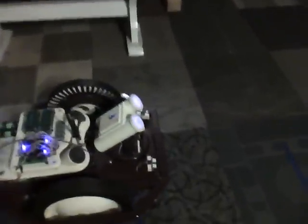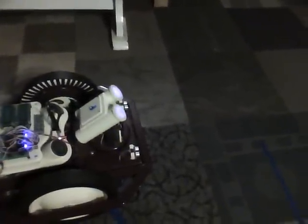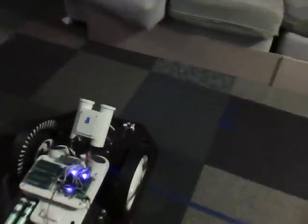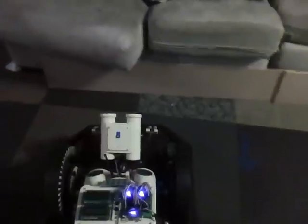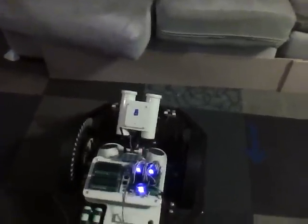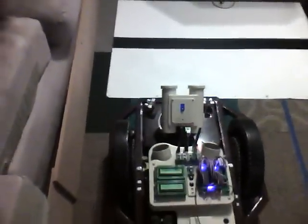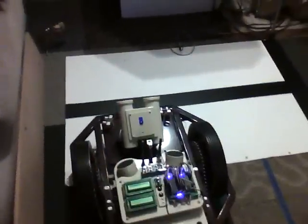As long as he turns to a given heading generally in that direction, he's going to hit that wall. So let's do that now. He's got a compass — good job, first try! He just turned to that heading via his compass. Now we're off on sonar. Wall detected — actually this is a turn off of encoders. Now this is a wall follow off of that sonar shooting sideways, a given distance from the wall, and heading — boom — 90 degrees. Oh, there's the line! I have found the baseline!